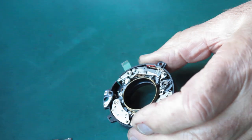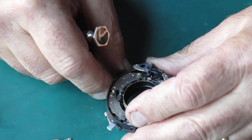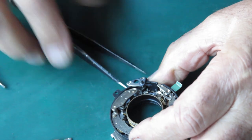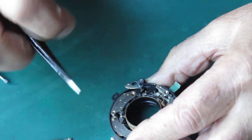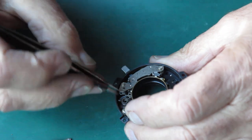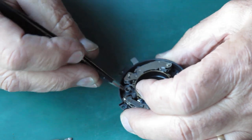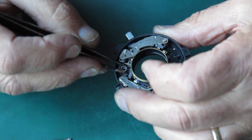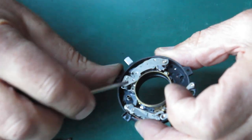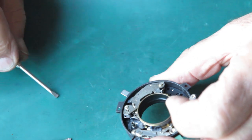Why has the shutter not run down? So it's cocked, but it's failed to run down. Well, let's move a few obstructions. See if we can get to the root of this problem. Out with the self-timer. I'm going to have to unhook that main spring. That's been sitting there, and that's even in quite good condition considering. We'll lift out that main cam. The retard gear train, what's that like? Well, it's pretty sluggish at returning, but it does return. Let's have that out.